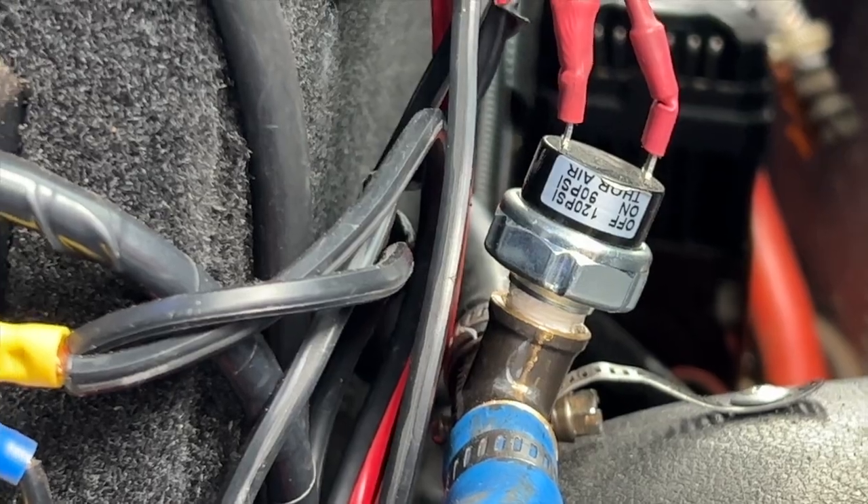The reason I put the pressure switch on wasn't really for this current setup — with the male Neato fitting it's not going to pressurize. But what I'm planning to do with my new air inflation system, which I'll be doing a video on shortly, is have a tap I can turn on and off while inflating to get an accurate pressure reading. That way the compressor will turn itself on and off without me having to flick the switch. If you're reading the pressure while the compressor is running, that's a false reading — the output pressure gives you a higher reading than what's actually in the tire. What you need for this setup: the pressure switch off eBay for about $17, a few air fittings, 3/8 inch barb fittings, and a T-piece with quarter-inch BSP thread.